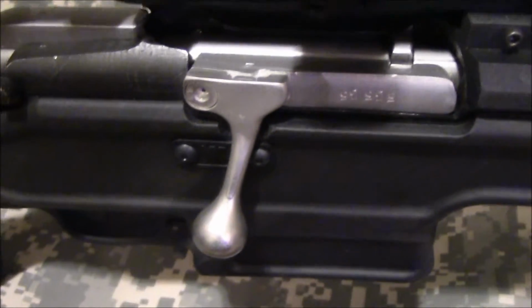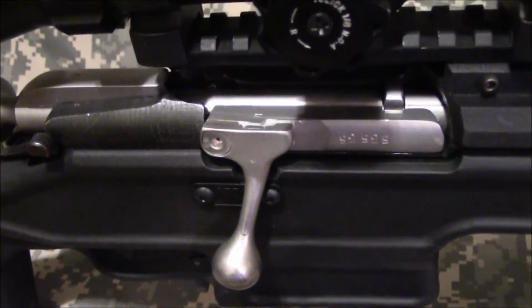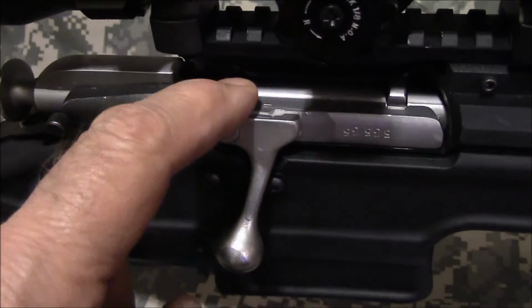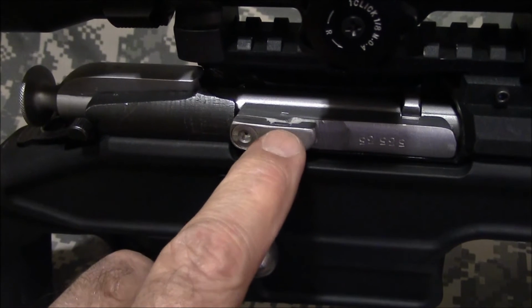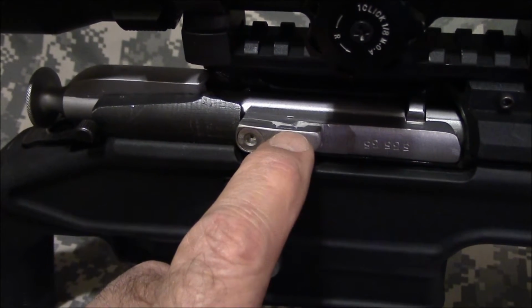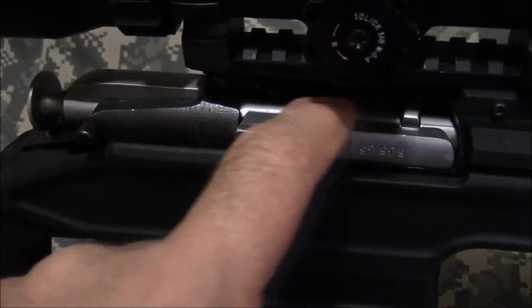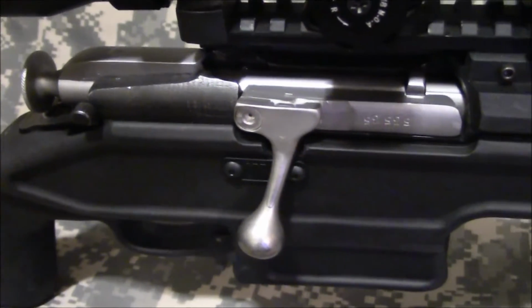I know I got in a hurry. I didn't try to take my time and make a really nice job. I just wanted to show you what to do. You will grind into that pocket though when you grind this far to get it this flush. It's still solid, and I think that JB Weld actually makes it a little more solid because I'm sure a lot of it got down in that pocket. But you have to have it flush with this surface. That's all this little short video is for, and it will work fine.